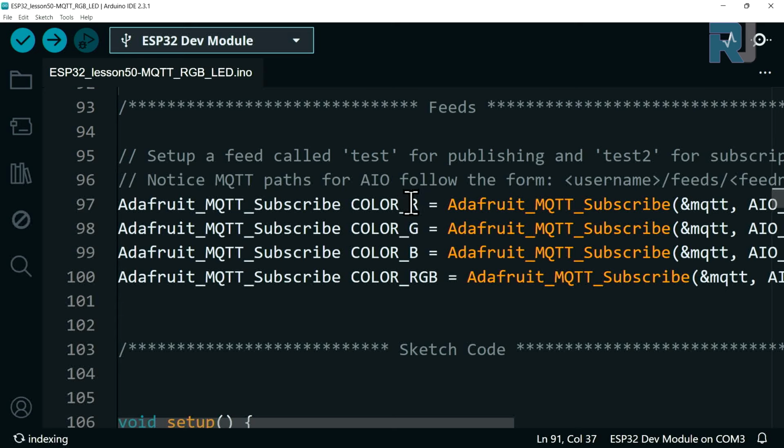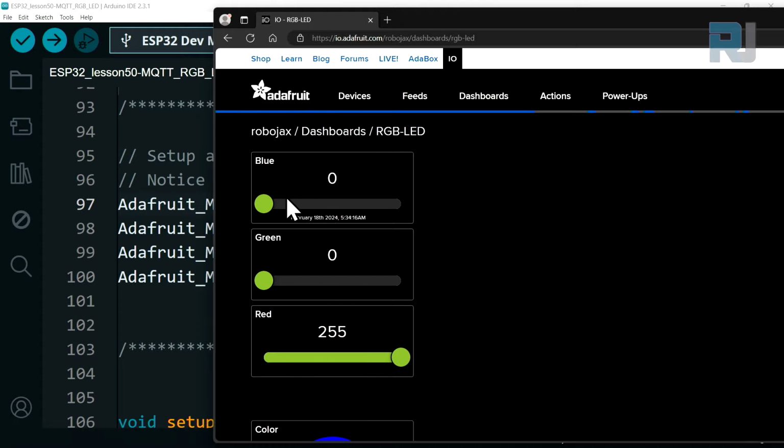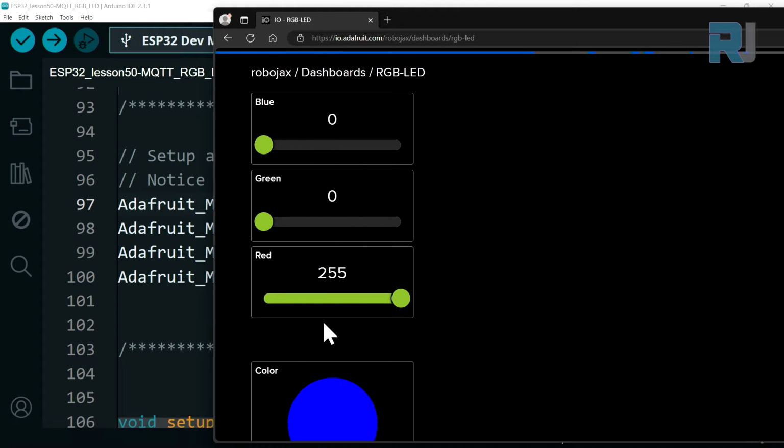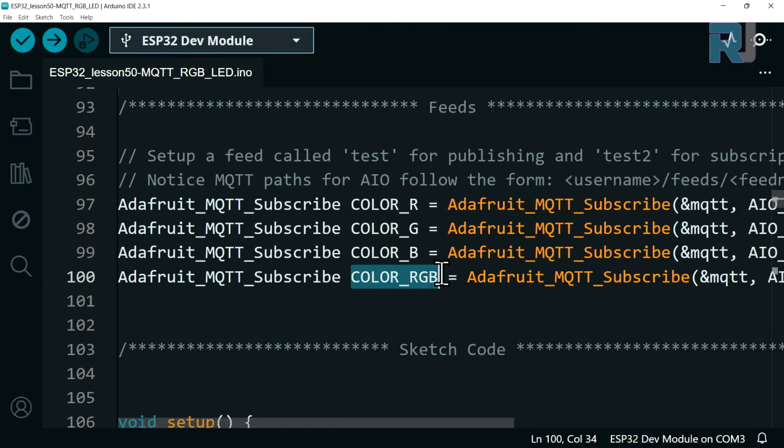And then we have created these three objects for subscription. And this is MQTT subscribe. I call the subscription object color R, color G, color B. These are each color separate that we receive from these sliders, R, G, and B. And then for the color picker, because it sends these three colors all in one, I called it color RGB.